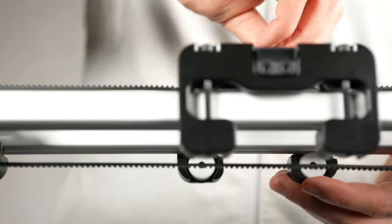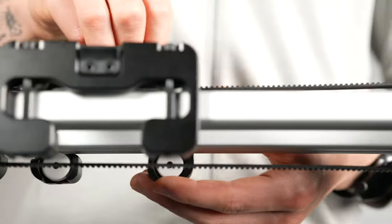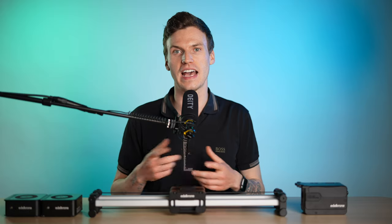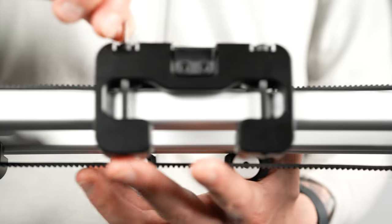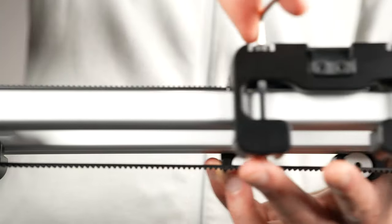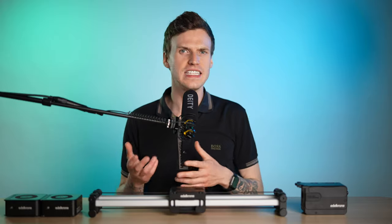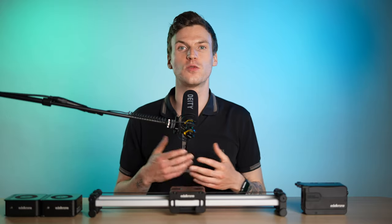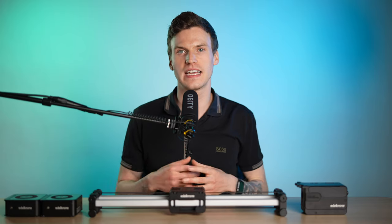The way to modify how much contact each side gets is by tightening the screws on each side of the cart with an allen key, which squeezes the wheels closer to the rail. The best way to make sure you aren't too loose or too tight is to feel the wheel underneath that corresponds to that screw on that side. As you roll the cart back and forth, lightly tighten the screw and as soon as there's constant rolling it should be at the perfect setting. It's a slightly different procedure for the inner cart because the wheels are harder to feel and calibrate.